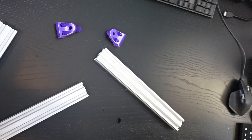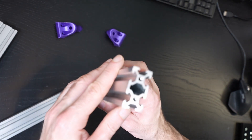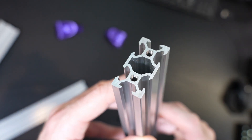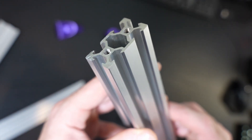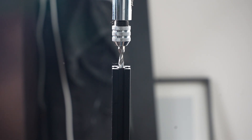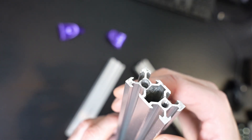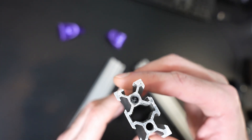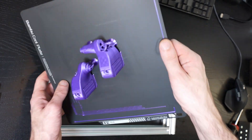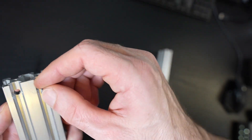Let's discuss the materials. These aluminum extrusions are incredibly useful in projects like this — they are easy to cut, easy to assemble, and you can construct almost any structure you need. One of the ways to fasten one piece to another is to tap holes in the center of the extrusion. I have mixed feelings about this approach because I am terrible at tapping holes — almost every time I attempt to tap a hole I end up breaking a tap, leaving it forever embedded within my machine. When this happens, the hole becomes unusable. This is what happened here, and for that reason I added those small gears to the axis holder. In the future I will try to avoid having to tap holes. On the other hand, when the process goes smoothly, assembly is a delight.